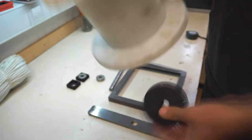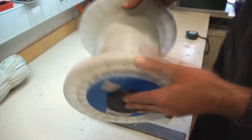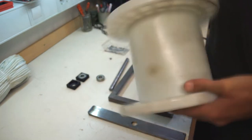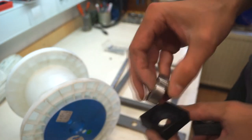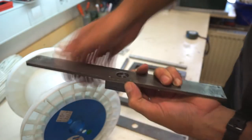The hole in the wheel is too big for the axis, so I simply make a flange with a 3D printer. This flange has 4 holes for screwing it on the wheel and 1 hole to put a steel stick through the axis to block it. There is no big weight on the wheel, so I didn't complicate it with bearing housings. I simply printed them.